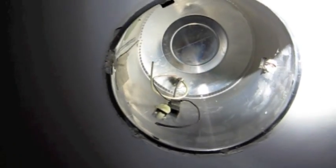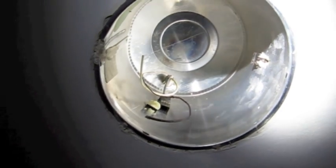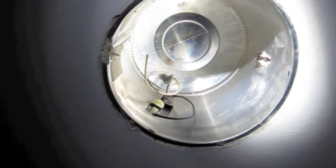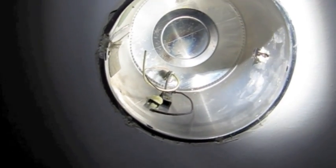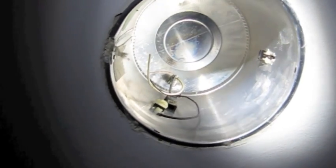Now some of these you don't need to cut out. If you have a screw bulb you can just replace the bulb. I prefer the GU24 mount because nobody can come along and switch out my bulb and put in a less efficient one later on. So this prevents inefficiency in the future.